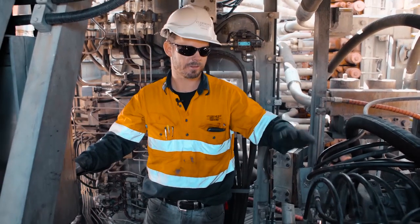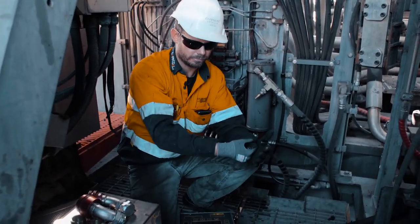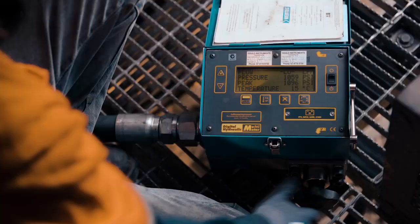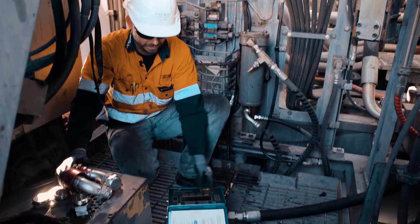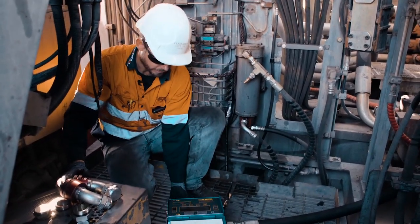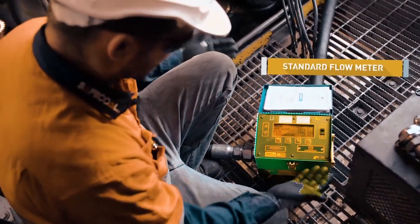With the engine running and RPMs correct, you come down to the flow meter. Generally you have a pilot valve with a ball handle hooked up to some hosing to trick the pump to go to the highest flow rate. Once that pump is stroked up to the highest flow rate, you come down and manually check your flows at minimum pressure. Then to do your testing, you manually rewind the adjustment through the pressure range of the pumps, checking in five different spots. This is your standard flow meter that everybody uses.